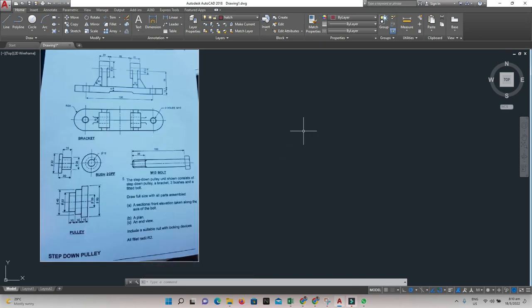All right, so drawing lines. So let's start things off by drawing a horizontal line. Let's go to our object layer, horizontal line, like this. This is to no measurement, this is random. Then I'm going to offset to either side half of the diameter, which is a radius of 20 here. All right, so the radius is what's indicating the width of this bracket here. So let's offset 20 on either side. So up and down, offsetting that.